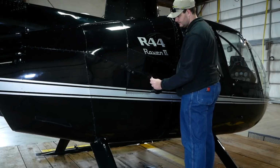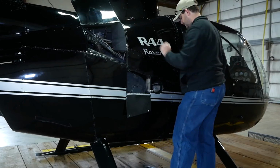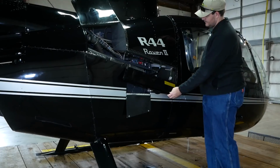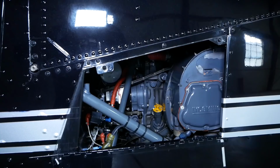The engine in this helicopter is a Lycoming air-cooled, because of course it is, there's a lot of air floating around here. Flat 6, technically a boxer 6, making 245 horsepower or thereabouts. The really interesting thing about this flat 6 engine is that it's 8.9 liters. It's a Lycoming IO-540, and the 540 means 540 cubic inches.